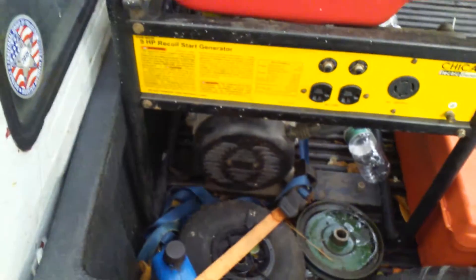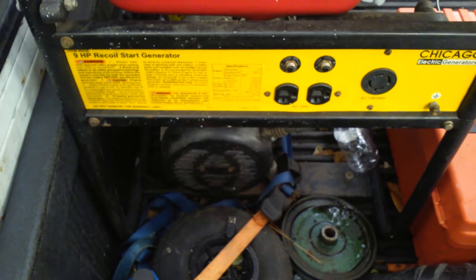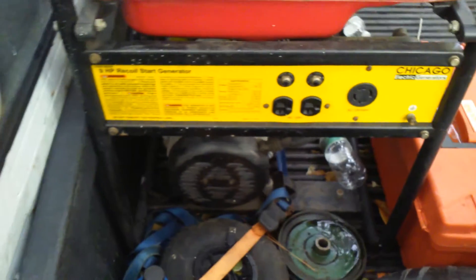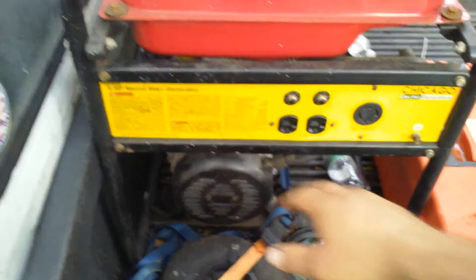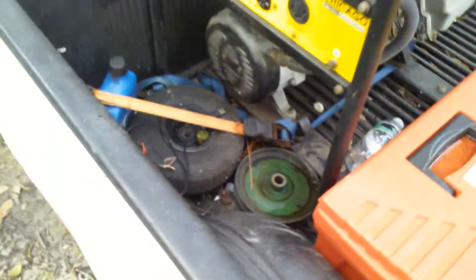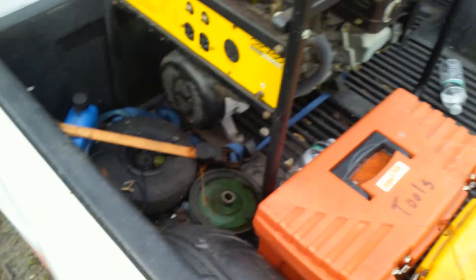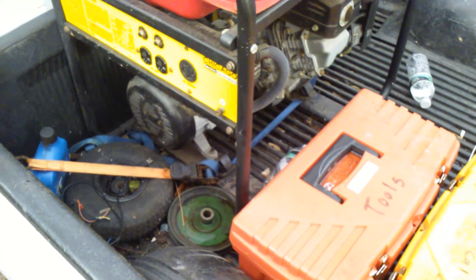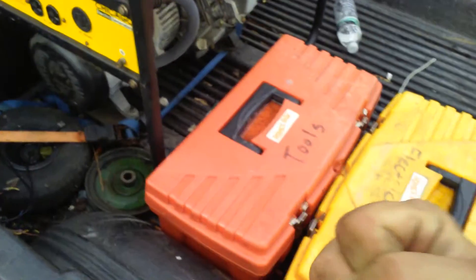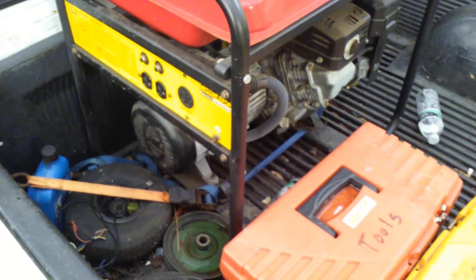I have a 5,000-watt Husky and this is supposed to be a 4,000-watt, so I'm not sure the wattage ratings are entirely accurate. I just wanted to show that you can step up your capacitor. It did not increase the voltage — voltage stayed the same. The only thing that increased was the ability to get things going fast. The air compressor now starts like a snap.